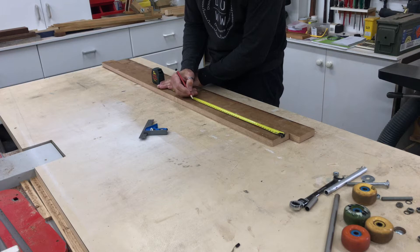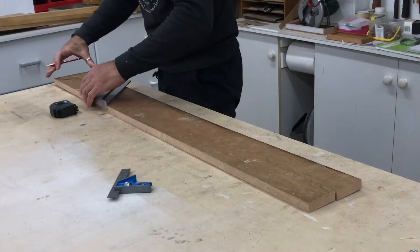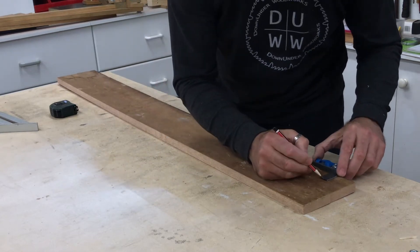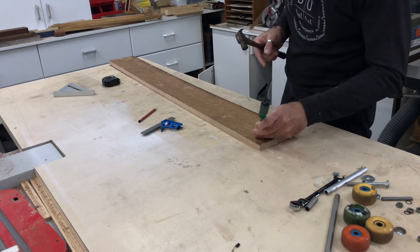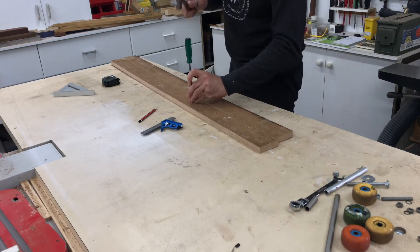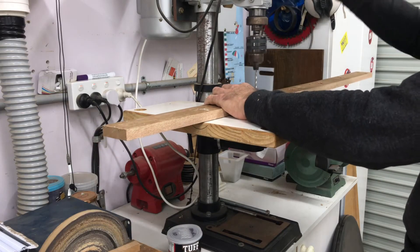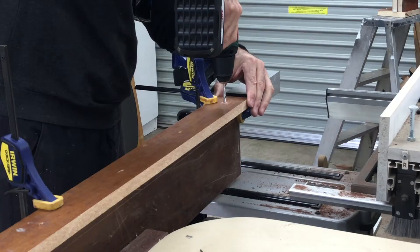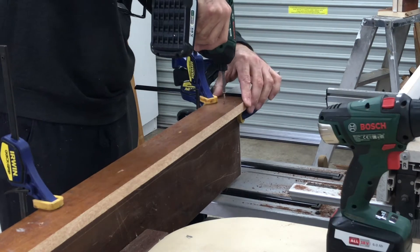The web piece was also cut from an old board and measured 1290mm long and 145mm high. I drilled clearance holes in the flanges for screws, and then when I had them in place I used the same drill bit to make a small mark on the edge of the web, then used that mark to centre a pilot drill and drilled pilot holes for the screws.